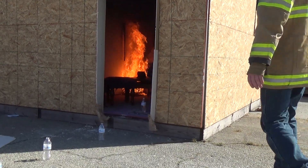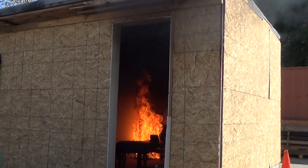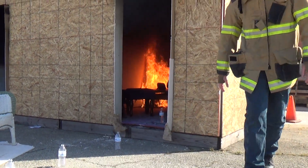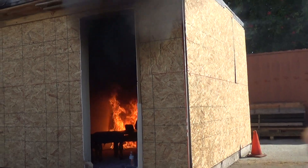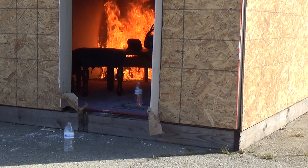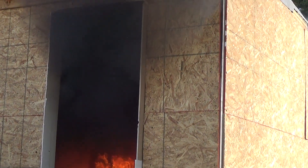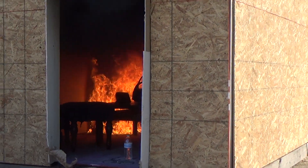You guys can kind of see the smoke layer — it's right about here. This is slowly going to start banking down, and once it starts going, you're going to see there's going to be a lot of pressure. Look at the entrainment at the bottom — it's already starting to suck in a little bit. It's got the side of the couch on fire, and you can see the velocity coming out. It's starting to build that pressure on the upper layer of your burn cell. Right now it's fuel-driven — the ventilation has got plenty of oxygen, so it's not really doing a whole lot ventilation-wise.